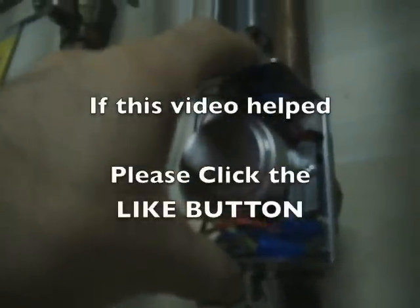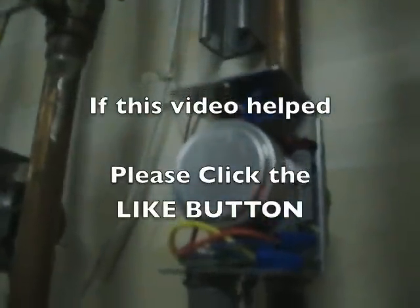So now I know the end switch is working and the motor is working. I figured it must be from the wiring. I removed these caps on here, used my multimeter again, and tested the wiring to make sure there was power coming up to this motor — and there was. So I knew that this was getting electricity when it needed it. From here, I figured it was not an issue here and that it had to be a thermostat issue.